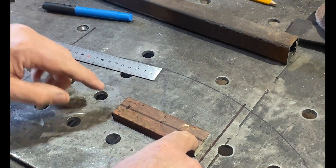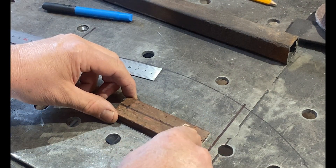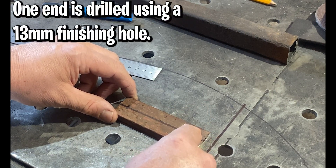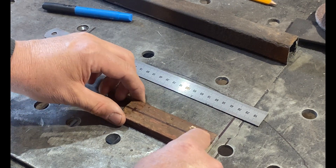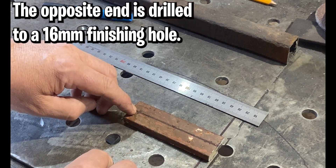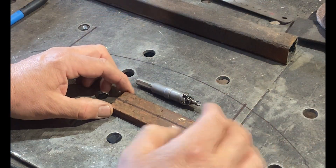Like we always do, we're going to punch those marks. At one end you will drill with a 13 millimeter drill bit — that takes your pushrod bolt through your tie rod. The other end needs to be drilled at 16 millimeters — this goes over our motor shaft.